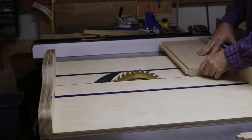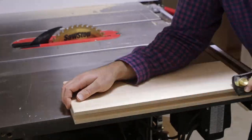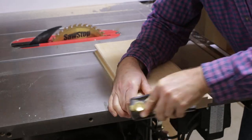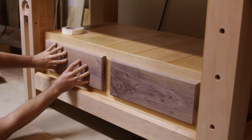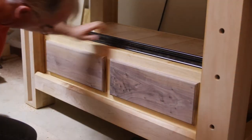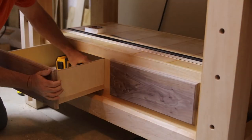Cutting the top pieces to length. I put some runners in the drawer cabinet for the drawers and a little top piece so that the drawer won't tilt down when I pull it out. I'm chamfering the edges of all the top pieces — that gave it a nice look I thought. I put some double-sided tape to help hold the front on until I got the screws in, just two screws in each one. In case it expands and contracts, that will allow it to do so because there's not four screws holding each corner, which would constrain it and possibly cause cracking.